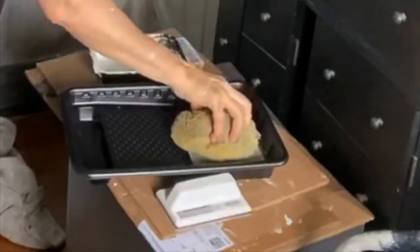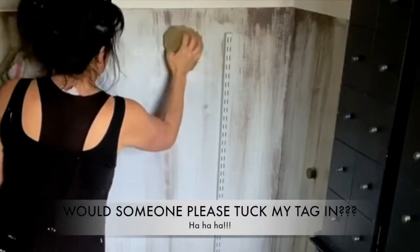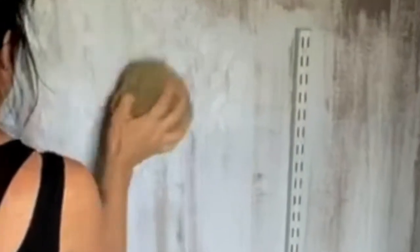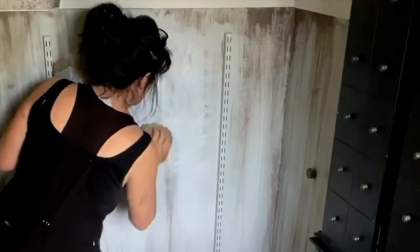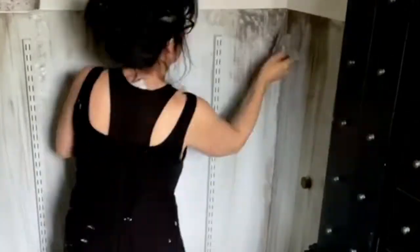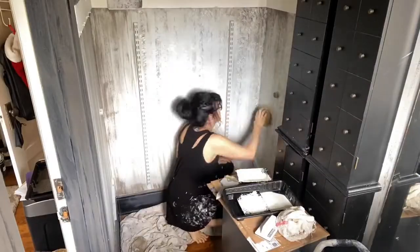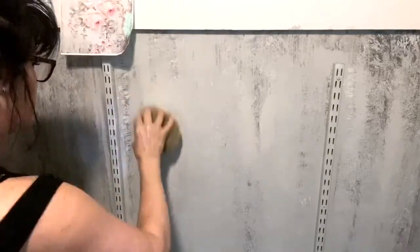Now I'm taking a damp sea sponge, dipping it into the wall color, and gently patting around. What this does is break up the obvious brush marks and makes it look more like paint peeling off a wall or wood — that broken-up, flecking look. Then I get the brush up into the edges, use the sponge, and take a rag and wipe it up and down. I'm also breaking up the long streaks because they're just a little too long.